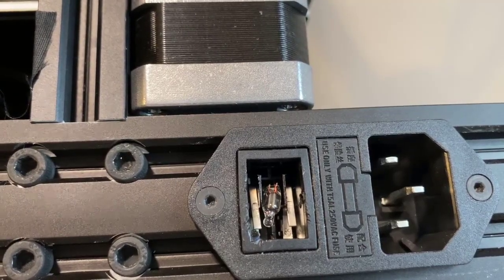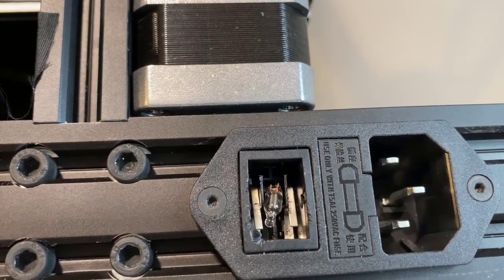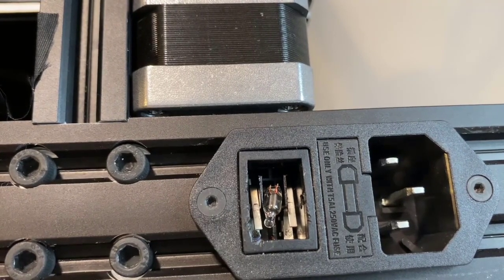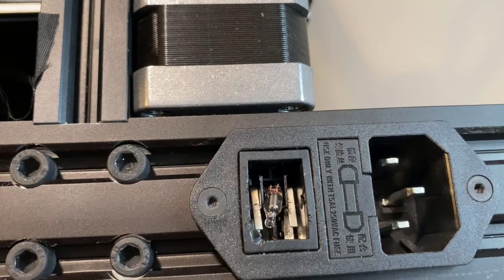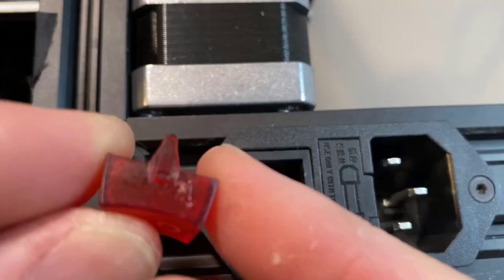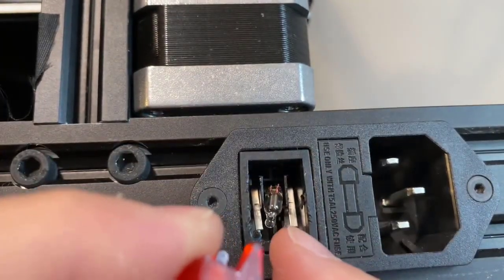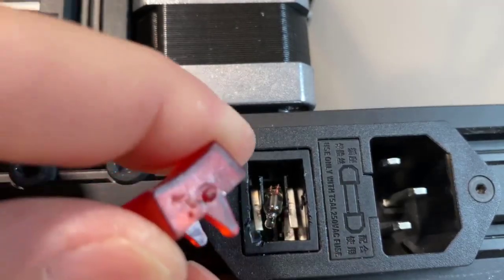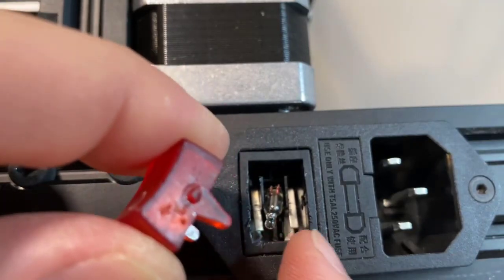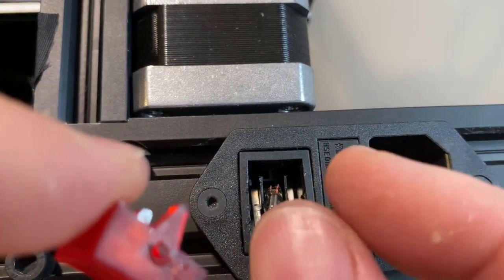Here is the other thing regarding the switch that I found very useful. First, you want to make sure you unplug it, but also I would leave the printer turned on and unplugged for a few minutes to dissipate any capacitors or other electrical tendencies in the machine. If you look at the actual switch, you'll notice it has a couple of little towers. What these towers do is make the connection happen — when you flip it to the on position, it makes those little towers rock a certain direction and changes how the metal contacts work inside the switch. When you turn it off, it releases that tension, making the pieces of metal disconnect.